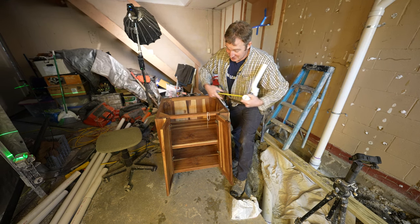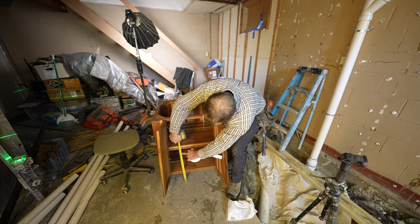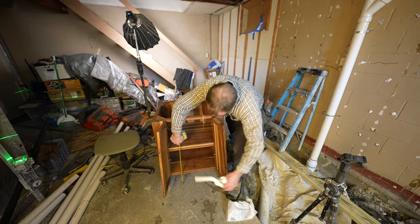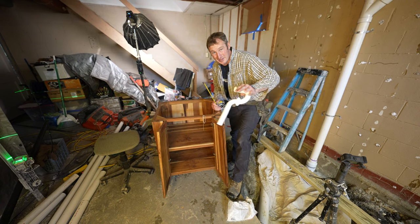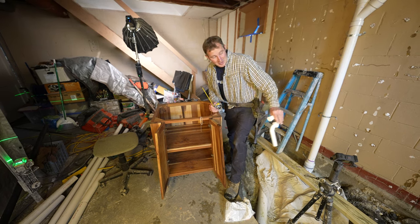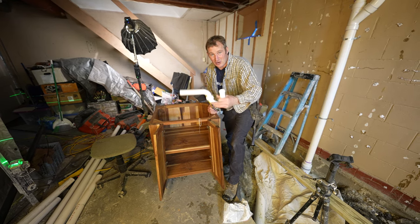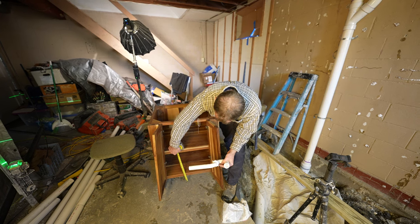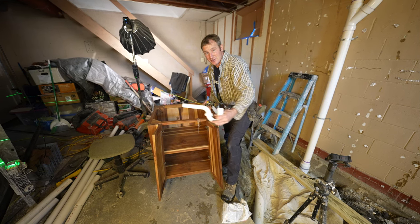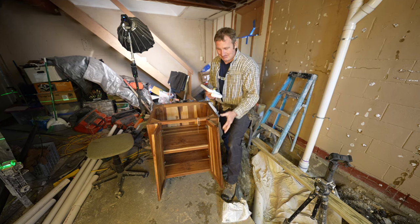So my suggestion is just to make sure that your outlet to your vanity is going to work. We're going to go with 16 inches, because then by the time we go and put this in, we'll be able to connect it. Now we're going to have a floor that we don't really 100% know the level of. I would pretty much think it's going to be about 3/4 of an inch thicker than what we have for the concrete. So technically, off of the floor, we'd be about 15 and a quarter or so, which would work out well. So just give yourself plenty of room so that when you adapt this, you don't have to do any adjustment or cut into the wall and readapt.